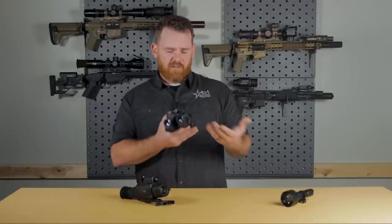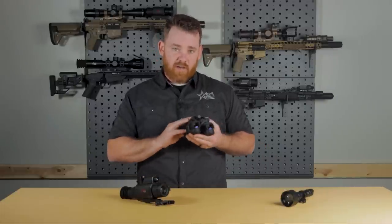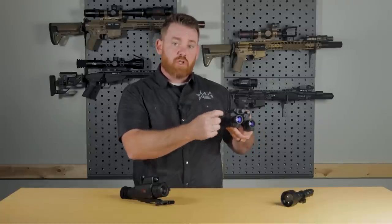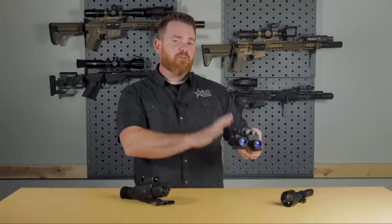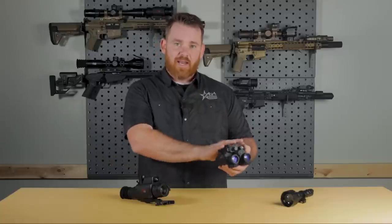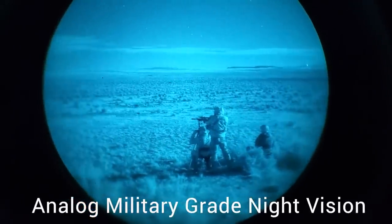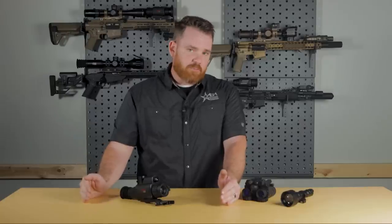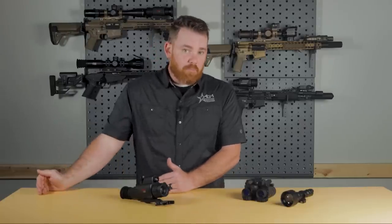And then there's traditional analog night vision. Similar to this device I have here — we'll do more videos about these later — but these are some of our NVGs. This is what we refer to as analog night vision. The night vision is basically happening in real time with the technology going through the intensifier tube. That is a very different and a lot more expensive kind of technology, but it is strictly for seeing at night and not detecting heat. So unlike thermal optics, when you're looking through a night vision device, you're amplifying the visible light that you already have available to you. You can also see light in the infrared spectrum that you cannot see with your naked eye, and thermal can't pick up any of that.